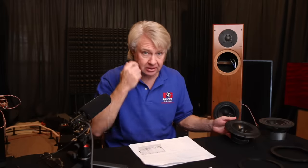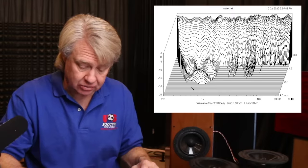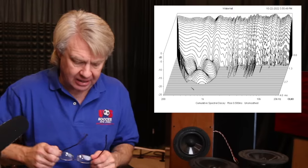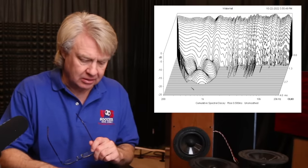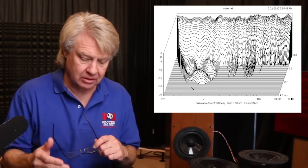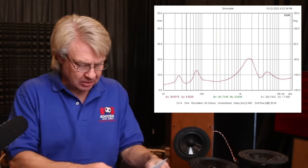The horizontal off-axis looks fantastic and smooth — this can be really good. The vertical off-axis shows a little dip as we move up higher. That's because the crossover point is at 3000 Hz — typically we cross tweeters at 1800 or 2000 Hz where wavelengths are longer, so phase rotation is minimal. At 3000 Hz the wavelengths are almost half the length, so you don't have to move as far for the drivers to start arriving out of time, causing that dip. The spectral decay is pretty clean overall.